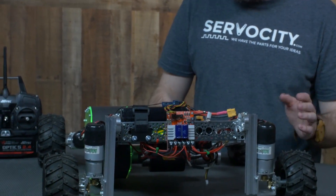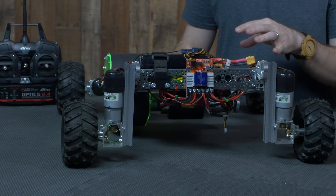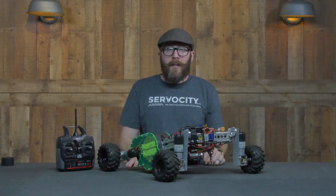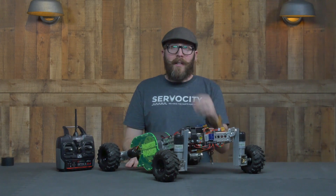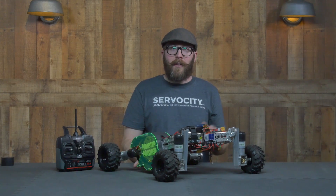For convenience and safety, I have a double-pole single-throw toggle switch which acts to disconnect all power from my batteries to the rest of the project. So if something goes wrong, it's really easy to reach in and just swat that toggle switch over and disconnect all power.